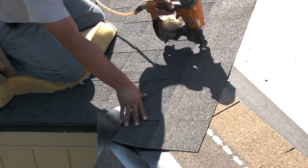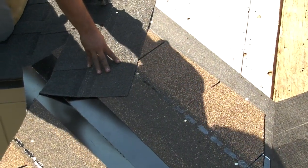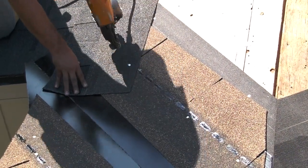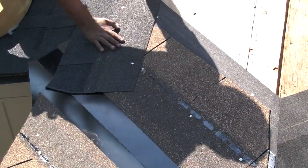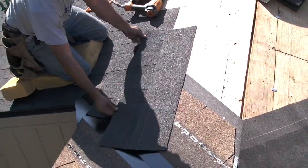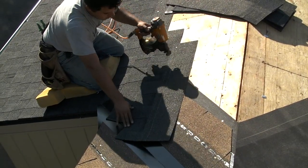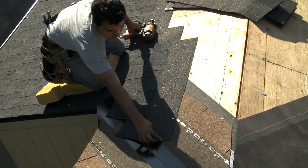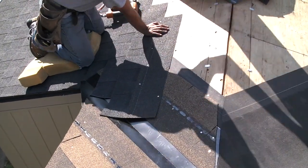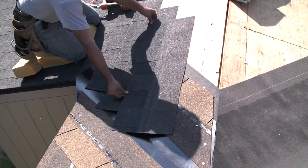Right there, the nailing — this is usually a very good guide for you. If you nail along the sealant here of the shingle. Now, some people leave it like this, or you get a situation where the top part of the shingle starts getting closer to the valley cut there. And some people leave it like that, and it's very incorrect.